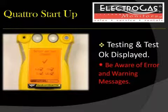At this time, your monitor will perform a self-test, and if all functions of the unit pass, Test OK will be displayed. Please be aware of any error messages that may be displayed at this time. They can include bump test failed, calibration past due, or air sensor failed. If any of these occur, please consult your supervisor or contact Electrogas Monitors.